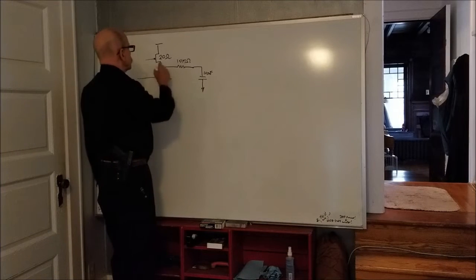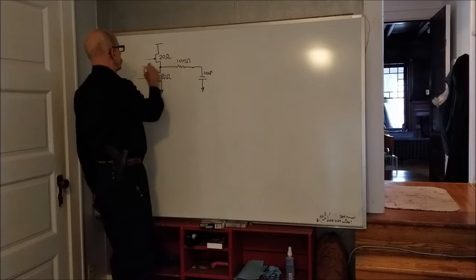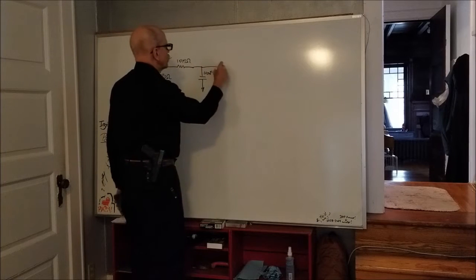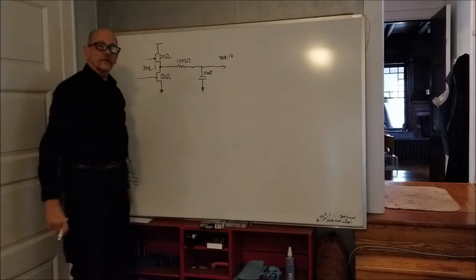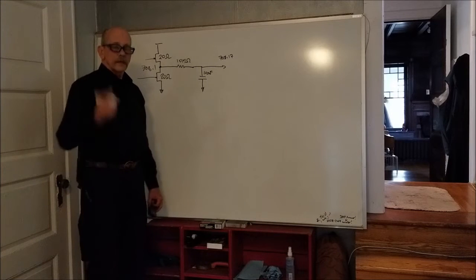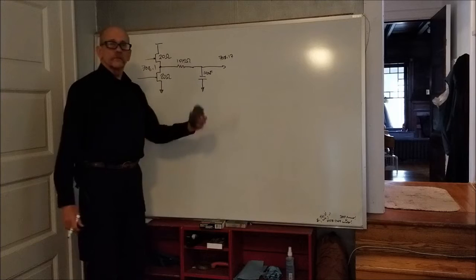So what we do is, this is node, say, 708.1, and we take and sample this to node 708.17, and we turn this guy on, let it go high, wait for it to cross our positive switching threshold, say cool, then turn around and drive it low to take it to the low switching threshold.